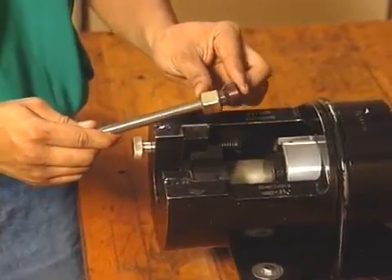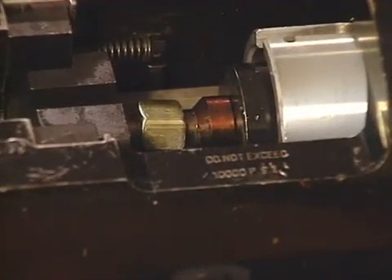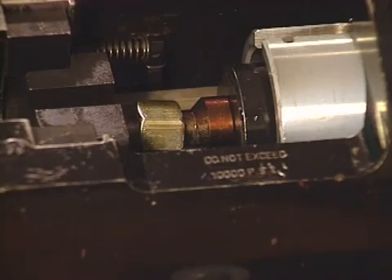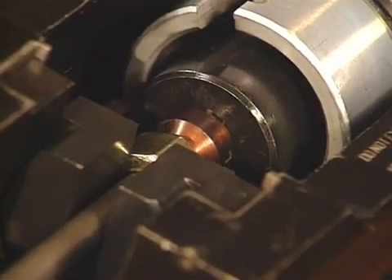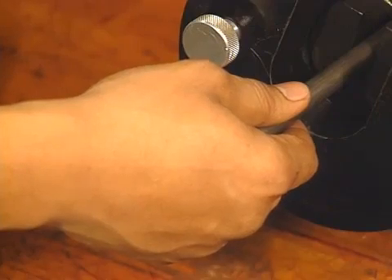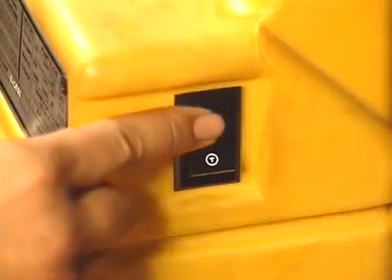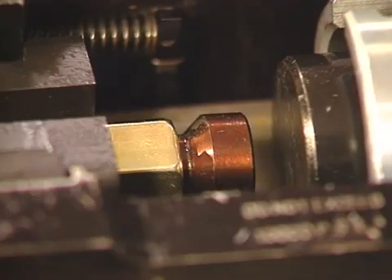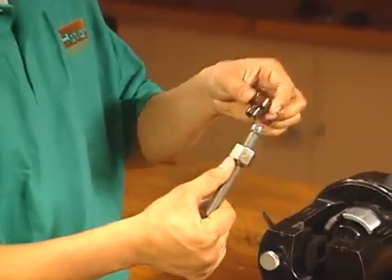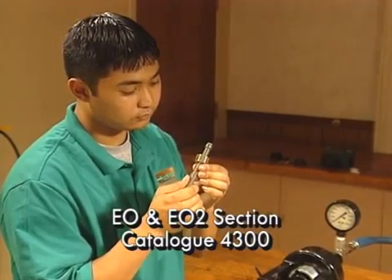Now, place the tube in the slot in the nut support with the body die, nut, and ferrule placed between the nut support and small RAM insert. Push the tube into the Hydra Tool until the body die contacts the small RAM insert. Activate the hydraulic power unit. The dual piston will advance, engaging the body against the nut support. Keep supporting the tube assembly while the piston moves forward and presets the ferrule. The pressure gauge will show a rapid rise in pressure. Once the correct pressure has been reached, turn off the power unit. The piston return spring will retract the cylinder and complete the process. Finally, remove the tube and inspect the preset. For the proper inspection procedure, refer to the EO and EO2 technical section of Tube Fittings Catalog 4300.